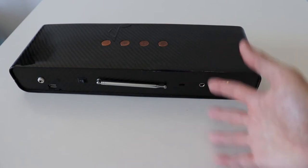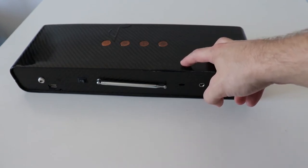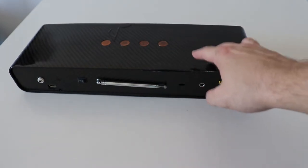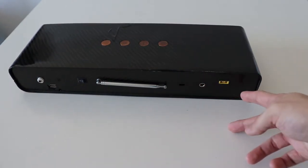And it doesn't matter what voltage you use, because inside of this there is a step down and step up converter with constant current and constant voltage limiting. So it doesn't matter what voltage you put here, it will always charge the battery at the same constant current and constant voltage rate. You can actually use all three of them at once if you want.